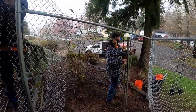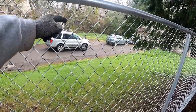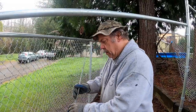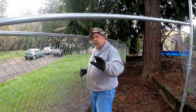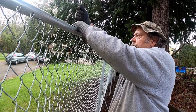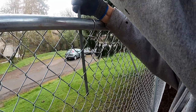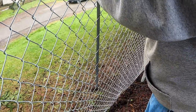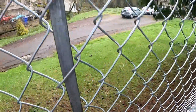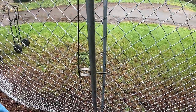Here we are. We're going to start stretching this. I come over here and put a tie right here, and we're going to stretch it this way. I'll end up putting a tension bar down in here and we'll hook our come-along up and our fingers. So I'm going to let Gus film me here. We've got our tie here. You want to put your tension bar on the front side of the tie from your stretching, because if you put it on the other side, you're going to end up binding when you stretch it.